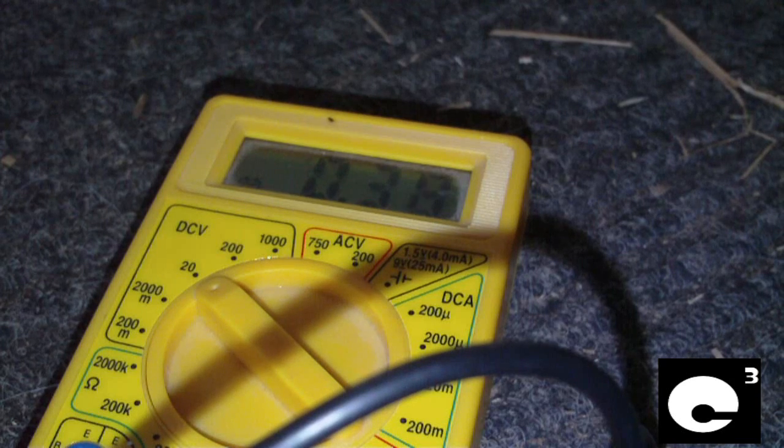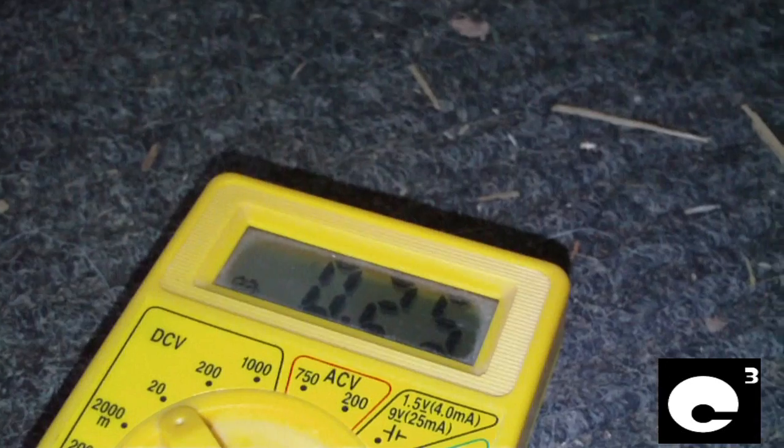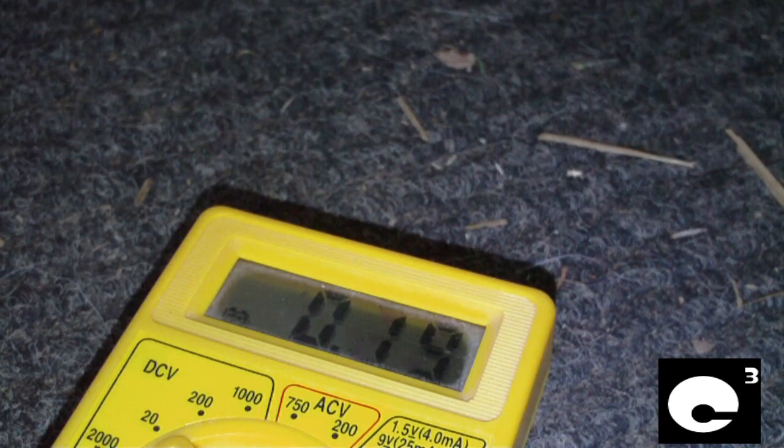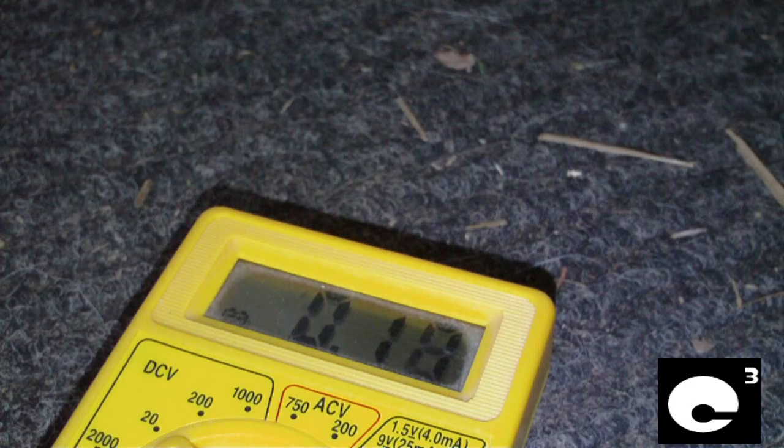When there's not much of a load, sometimes they cannot regulate themselves very well. Now as you see the voltage has gone back down — it's at 0.23 volts as the capacitors are still slowly discharging. I'm going to flip the switch and turn the power supply back on. Of course it's not going to run, it's just going to get AC power. Right back to 5.11 volts — no overshoot at all. It just went straight to 5.11 volts.